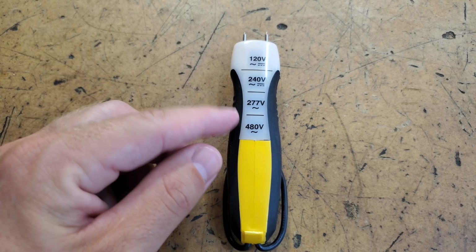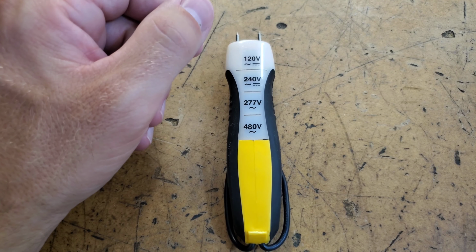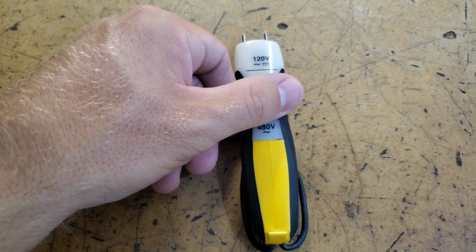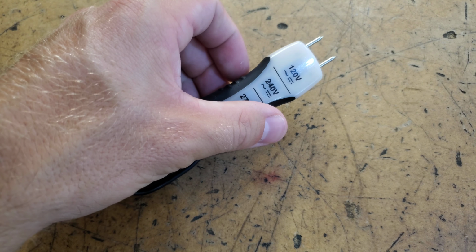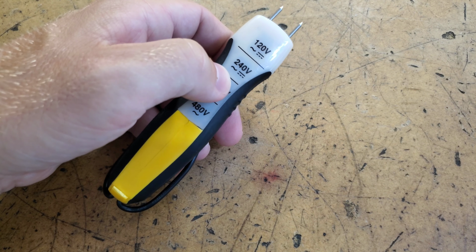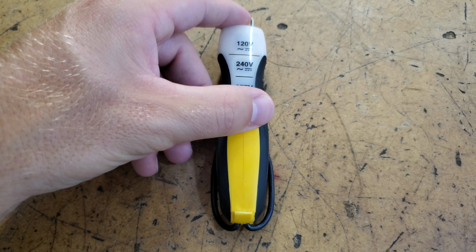Every inspector needs this. So if you're an inspector and you're watching this, make sure you have this, because you will run into a house that does not have grounded receptacles, and you'll need to use this to test the receptacles to make sure they're working. And you will run into homes that have electric dryers or ranges that aren't present that you need to test that receptacle for. Or you might get a guy who's got a garage that he wired a 240 volt in for like a welder or an air compressor or whatever. So make sure that you get one of these, and like I said, I'll link it in the description.